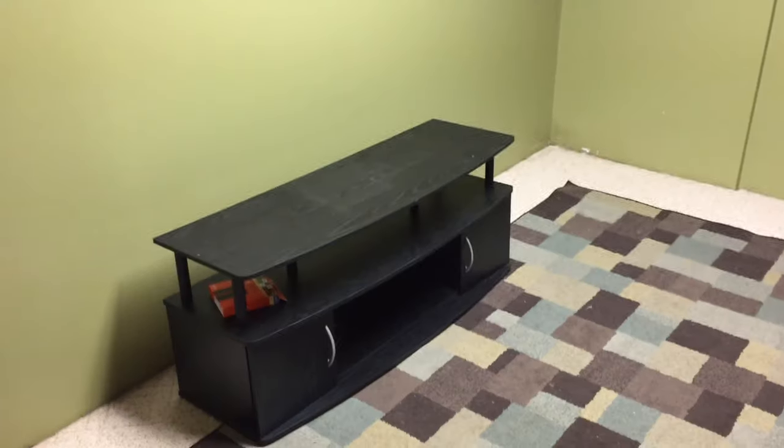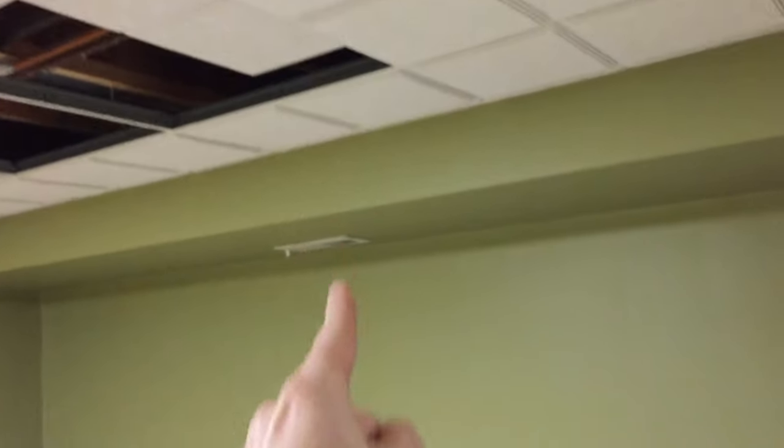Next up is the entertainment center. My first choice would be to run the HDMI up behind the wall, between the studs, above the drop tile ceiling, and pop out behind the projector. Unfortunately, I had a few challenges. The wall with the screen is concrete, so I could not run anything behind it, and there are no electrical outlets. So I will have to route the wires along the floor to where it is not a concrete wall and I can get into it. I will add an electrical outlet and a port for cables to travel through, then run the HDMI up and back to the projector, popping out of the wall through a port behind the projector.